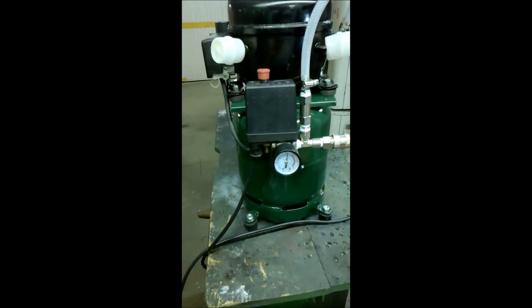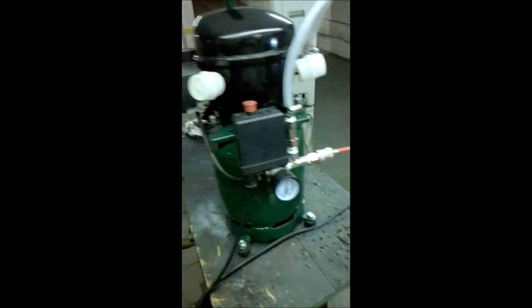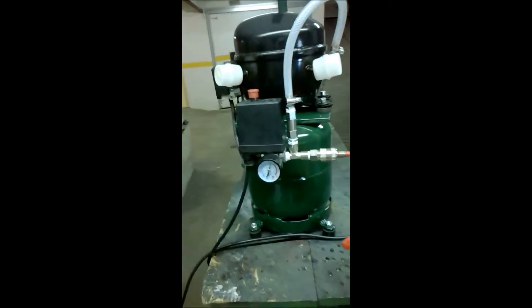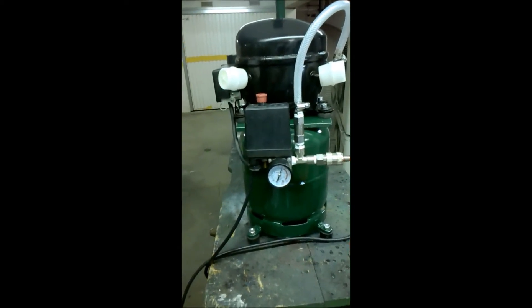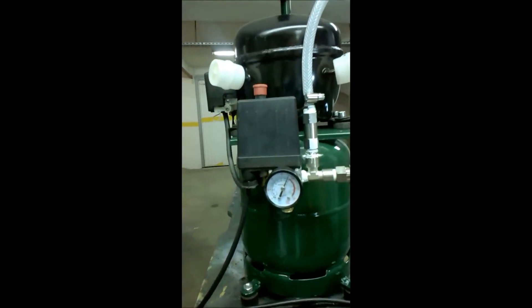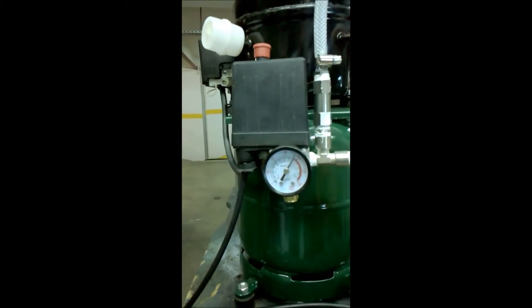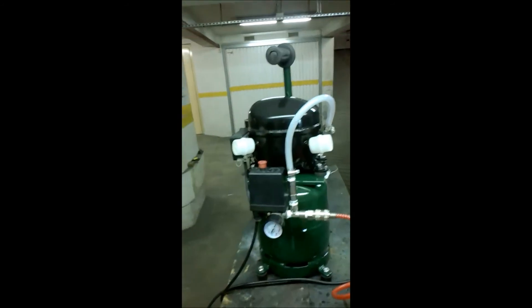I have a charge valve for the bottom — it is available to remove the condensate accumulated in the deposit. It will turn off. It is almost at 8 bars, it will turn off. It is at 8 bars, as you can see. It is more than this.